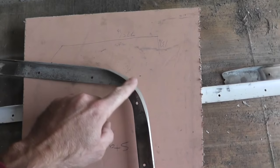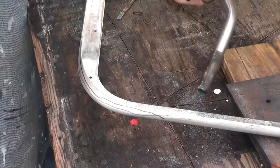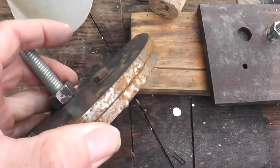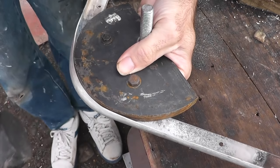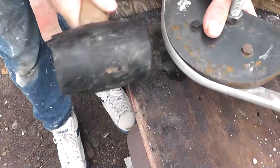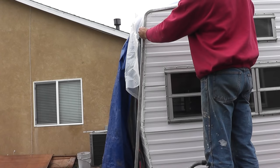It still needs a little bit of work right here on this edge where it curled over, but overall I beat the odds. Before I work on this edge, I'm going to re-anneal the area to make sure the metal is as soft as possible — I don't want any cracks. To fix this area, I'm using a metal cutout of the correct radius — two pieces of quarter-inch steel from a previous failed experiment. I'll nestle the piece in here and give a gentle finesse with a rubber mallet. Let's see how it fits on the trailer. Not too bad — just a few more minor tweaks and it should be ready to install.